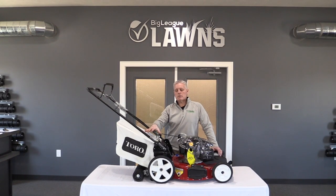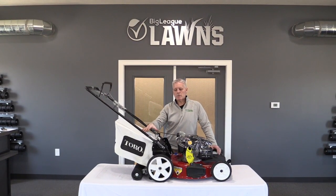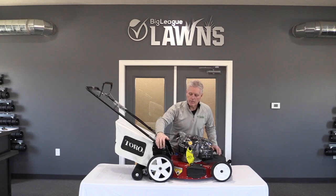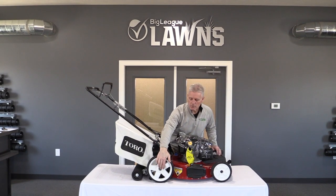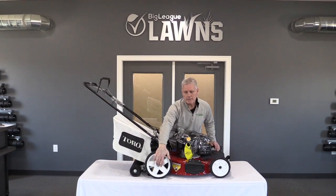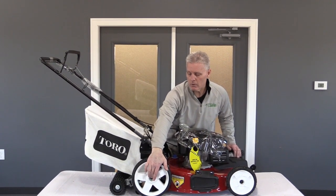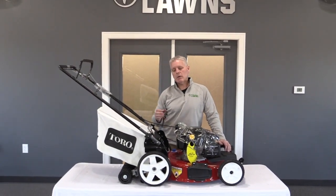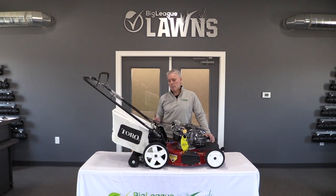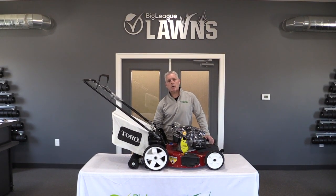You're going to find that this mount today is nearly identical to most mounts that we typically use for the Checkmate long striping kit, with one exception: on this particular mount we have an axle bolt, and we're going to take Toro's axle bolt out and replace it with a new part supplied in your kit. It's extremely important — we want to show you those steps first, prior to starting the step-by-step installation, because we have to make absolutely certain that the roller is able to float up and down freely.